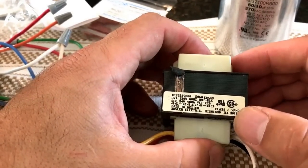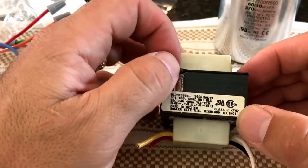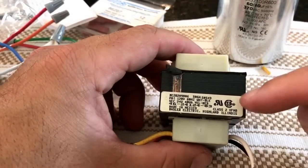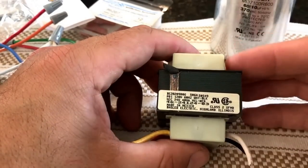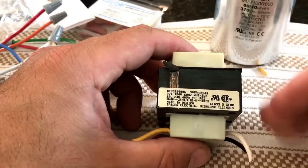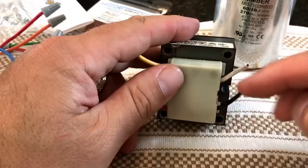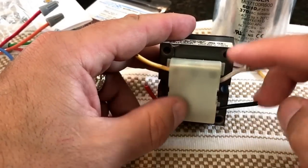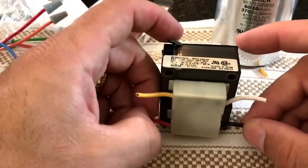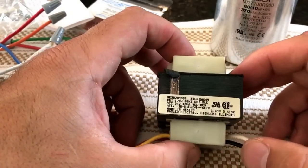There's definitely something wrong with the furnace itself. So this is a transformer. On the back of the panel you'll see information — go down the list to check these things. I used a multimeter and found out that this was bad. This is the power coming in so it was always hot, and then your neutral — these are the two wires. By the way, I'm not an HVAC guy or electrician. Just watching some videos and doing some research myself, I figured it out.